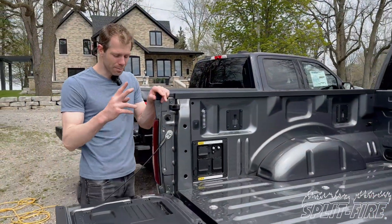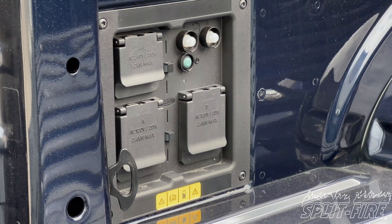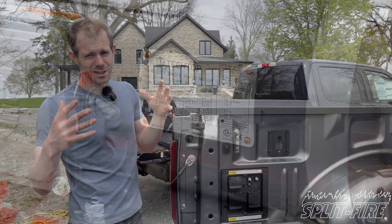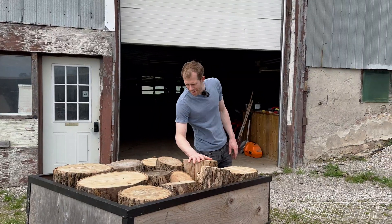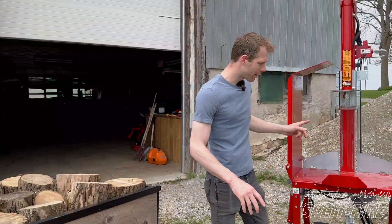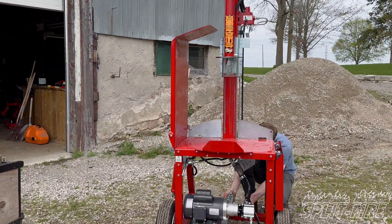On both trucks we have a couple of options: we have a 240V 30-amp and two plugs that are 120V 20-amp. That'll work perfectly for this splitter — it'll run on a 15-amp circuit but 20 is always better because you can get a little tougher on the wood or use a longer extension cord, though shorter is always better. As far as wood, I think this is some of the elm we had before. This stuff's been drying for two years so it's not the easiest to split, but it'll work great for the video. Here we have our little 1165 electric — 115V with a 15-amp circuit.